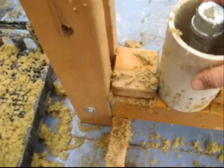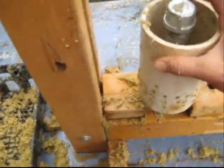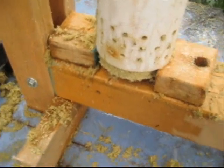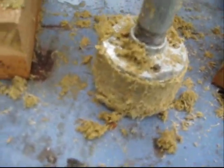Then we raise the press. I've got these two little blocks — we bring them closer together just on the edge of the PVC. We come down one more time with the press, and to eject it, pushing down will push out our briquette. Then we press down on that center piece — it's a bit tricky to do single-handed. There we go.